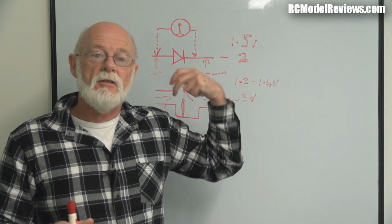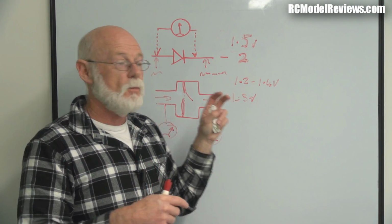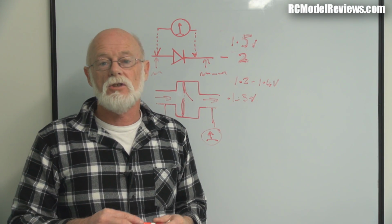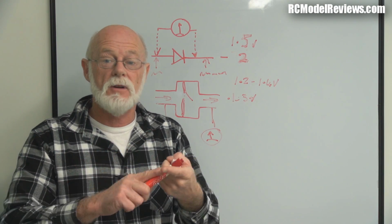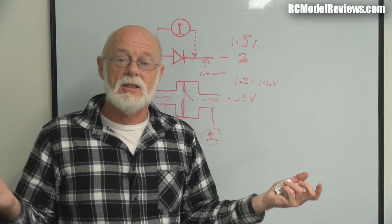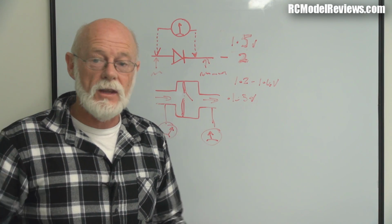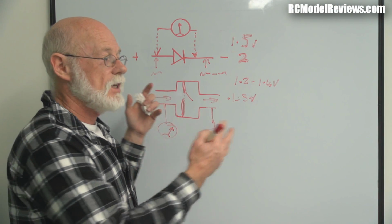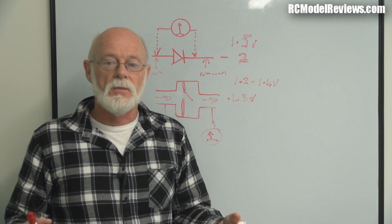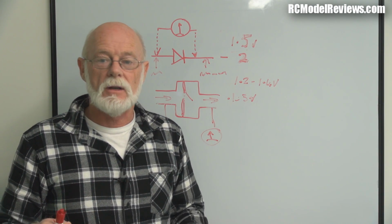And so really the 7.4 volts at which it has a hissy fit is really 6 volts by the time we get to the LCD circuitry itself. It's probably designed to operate from 6 volts upwards, but because we've lost 1.5 volts, it starts spitting the dummy at 7.4 volts. So that's why. So in a way, it's a good thing. It's a very good thing, because it means our LCD electronics are protected from silly people who might wire up a battery lead backwards or just do something stupid.